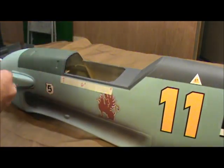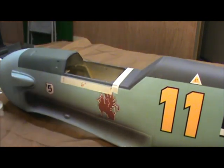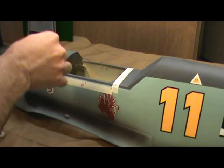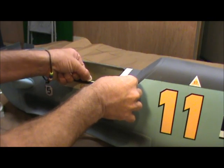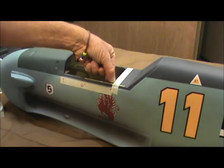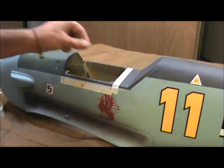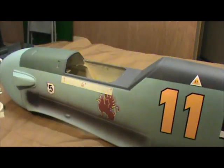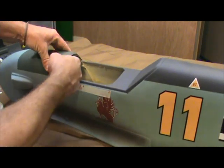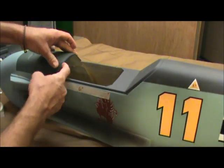Up here, I'll put a piece of tape across the back - just lay a piece of tape across that back line. And from wherever this eighth inch tape falls - I'll show you real quick - I got the eighth inch tape, and like I said, this is closer to three sixteenths, but I could have just a tad wide. Anyway, once I got those two tapes on there, I measure up one half inch, make a mark, measure in one half inch, make a mark - and it gives me my diagonal on the back side. Once I did that, I got that all marked out, I cut the area out that I had marked. And then I come across here and I cut up the dash - I removed the dash and left just a little bit less than an eighth inch, right at an eighth inch all the way around.